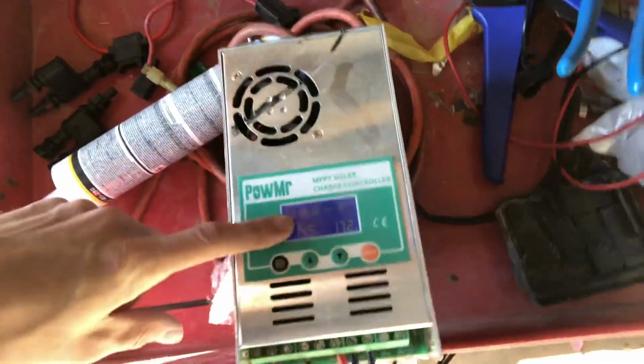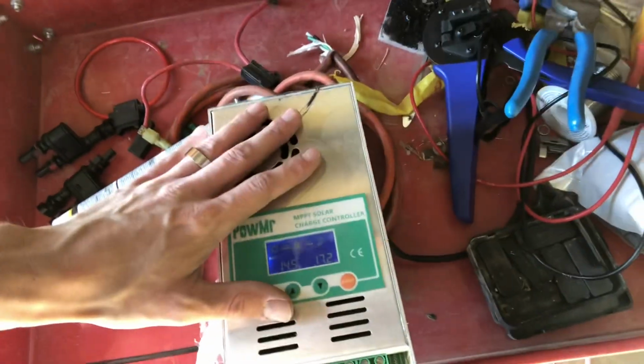So right now we've got these 400 watt modules. I can show you what we've got here. They run a 49 volt open circuit, which is great because for 400 watts you're only having to run 10 amps through that wire. But we've got these MPPT charge controllers, which seem like pretty good controllers for what we're using them for. When you're running a 49 volt open circuit and you've got a 12 volt battery, you can only run one in series, you can't run two. And these controllers would run 2 panels. So then you end up running 4 wires back to the controller.